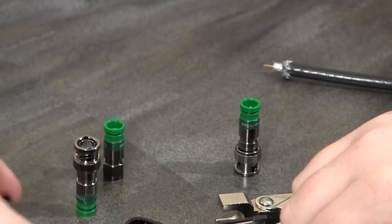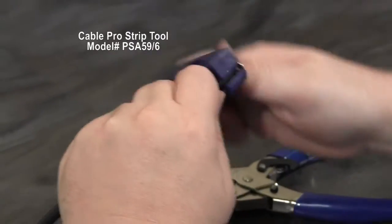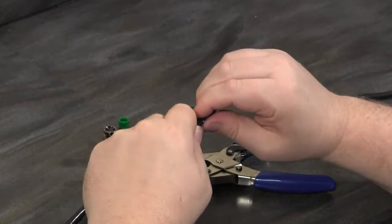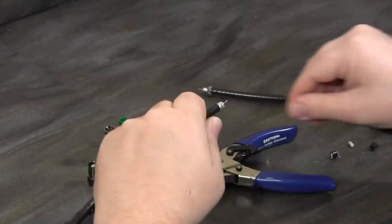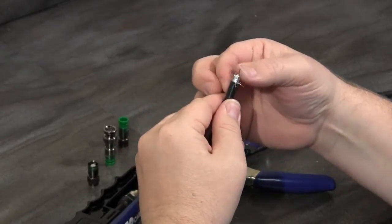When I go to prepping the cable, I use a quarter-quarter prep tool. Three or four rotations is all it takes to remove the jacket and the excess away from the cable. I'll then pull back the first layer of braid as a first step.